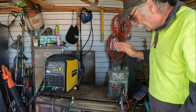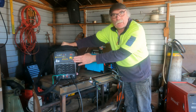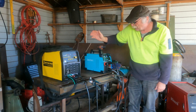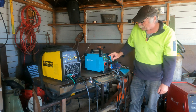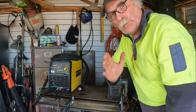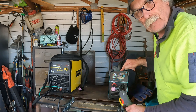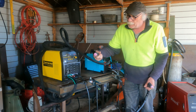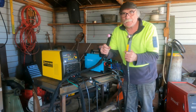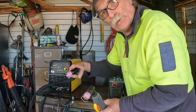So let's see how the plasma cutter with the built-in compressor can compare with that. For this little experiment, I'm going to be using the Bestark 7th generation machine, and for our plasma cutter with the built-in compressor, I'm going to be using the GetStar 40 amp machine. These machines are quite comparable — this is a 50 amp machine and this is a 40 amp machine, but I can dial this down to 25 or 15 amps if I want to. So if I set them both at 40 amps, we should have a fair test. I'm also going to use the same plasma torch on both machines, because they have a little bit different torch. The Bestark 7th generation runs the AG60P torch and the GetStar machine with the built-in air compressor runs a P60 torch — but they're both manufactured just a little bit differently, and maybe this torch is designed for a lower air pressure. So to make it fair we'll use the same torch on both machines.